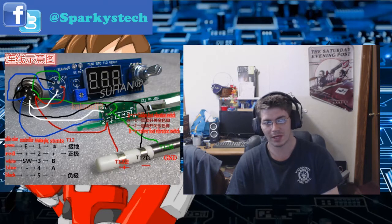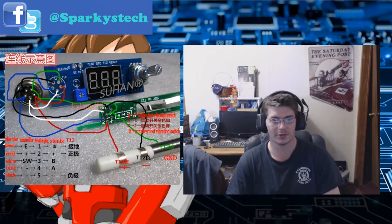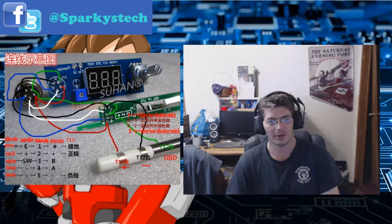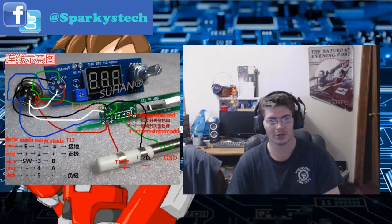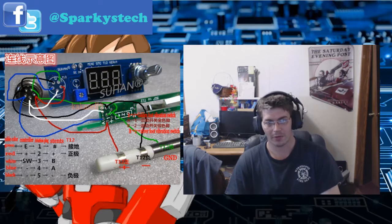And both those negatives on that switch both connect to each other behind the circuit board, so it doesn't matter which one I use. So down at 7 o'clock on that circuit board, I'm just going to jump it right there, and that should allow the whole thing to work. And then we have our regular 3-amp power and our negative.